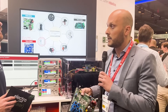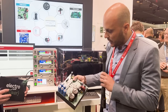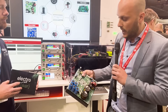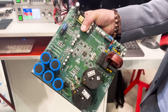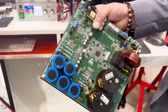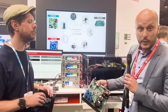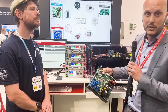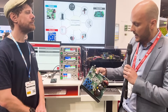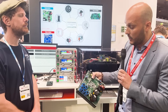In this case, I'm showing the inverter stage — this is the board that is going to drive your 1.5-kilowatt compressor, and it's also the board that is going to drive your fan. In addition, it handles the digital power controlling. We do all of that with only one device: our C2000 chip, which is able to run the compressor, the fan, and the digital power with a single device. This is a variable frequency controller, so efficiency is going to be pretty high — we're talking more than 90% efficiency.